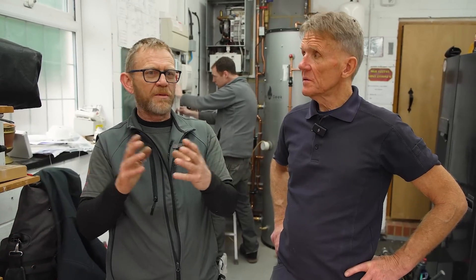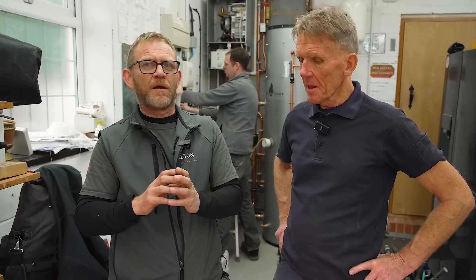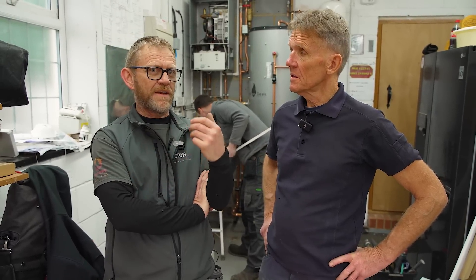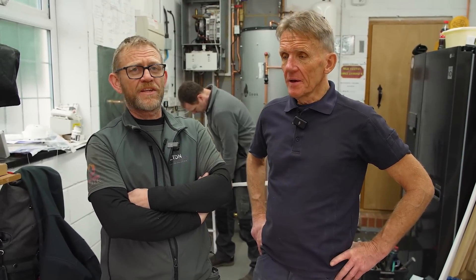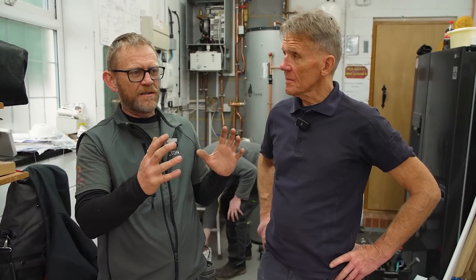With this particular system you just design to five because the heat pump does about 85 percent of the work. Looking at the data we've had, mine through the winter has done about 85 percent of the heating load, and my heat loss was 6.4kW, so it's working and keeping up. It doesn't have to be fitted specifically with the Intergas boiler — it can be fitted with any OpenTherm boiler, so potentially a Viessmann or a Vaillant or the Alpha, as long as it's OpenTherm compatible.